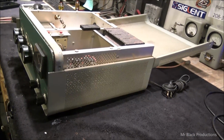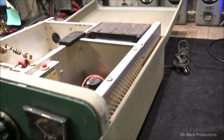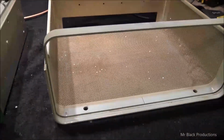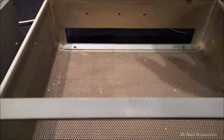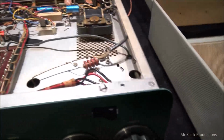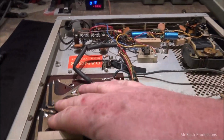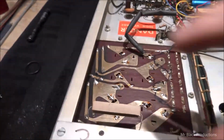As I take the tin off, we're going to take a look at the inside and see what we've got going on for guts. So just give me a minute. We're going to take the armor off. Well, we slid the amp out of the armor, and we've got an incredibly thick cigarette stain on the inside. That's okay, not a big deal. But this thing has come apart a couple times. The bleeder circuit is just about cooked off on this board. That's okay, it's still intact.